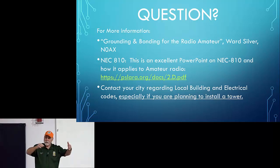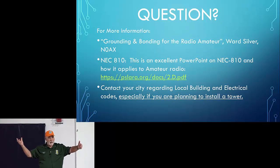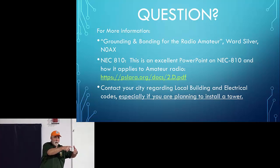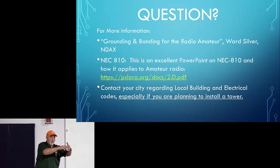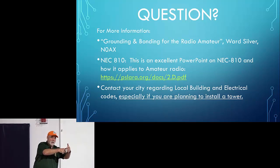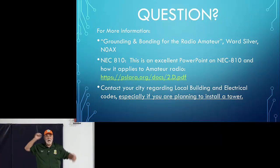Well, again, there's a small tax paid as that radio wave travels down the coax to the antenna. And now, let's say that 10 watts went back, a watt was lost, so now 9 watts goes back to the antenna. 90% of that power is radiated. 10% is sent back to the ATU, pays tax along the way, and then the ATU turns around, sends out 1 watt back to the antenna, and it pays another tax, and then it's radiated.